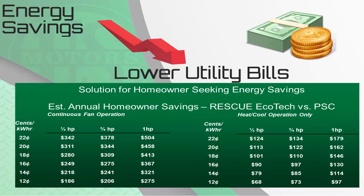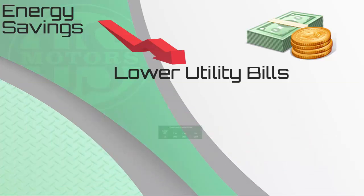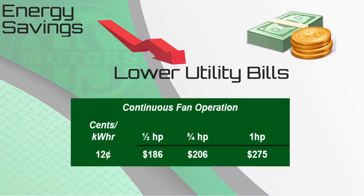Now for a closer look at the energy savings. This chart shows calculated annual savings for both continuous fan and heat and cool operation when switching from a PSC legacy product to a Rescue EcoTech. It is broken down by horsepower and price per kilowatt hour. You can use these examples to get an idea of the savings you or your customer will see based on the price of electricity in your area. I'm going to zoom in on 12 cents a kilowatt hour, starting with continuous fan operation.